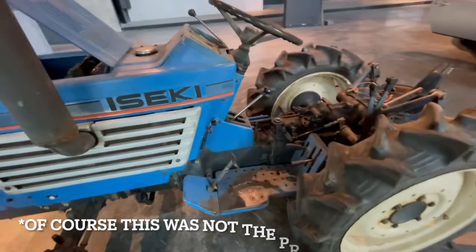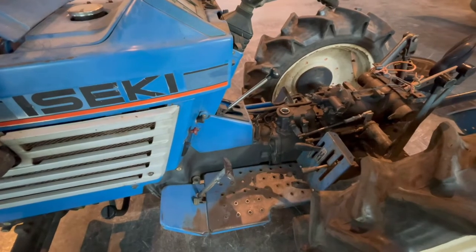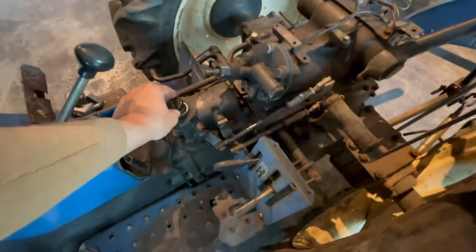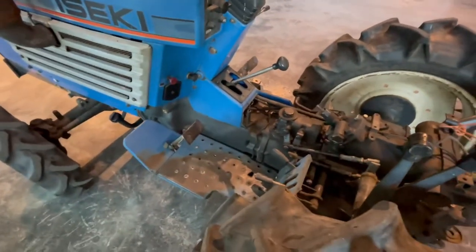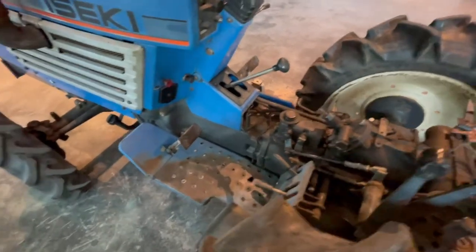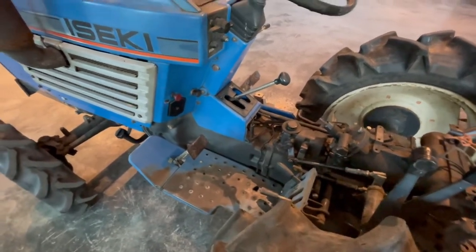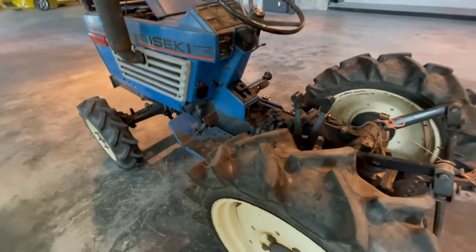And if I smell this oil, I really think this is hydraulic oil. So this is not good. I will change it for transmission oil. And perhaps the problem was solved with the old hydraulic pump. But yeah, now it's broken. So I need to buy a new one. And of course, I don't need to buy it because it's in our stock. So we will try to change it, and I think the problem will be over. I will show you in the next video how we will fit the new hydraulic pump.